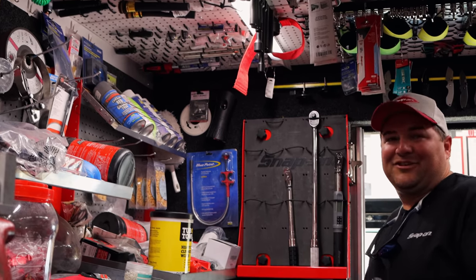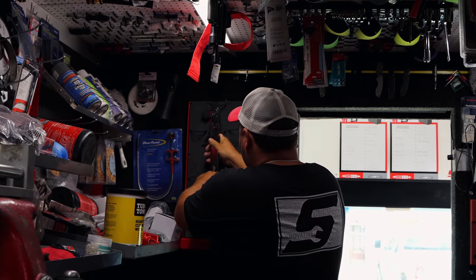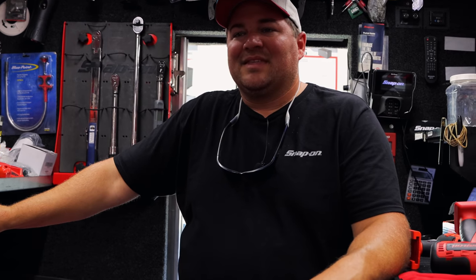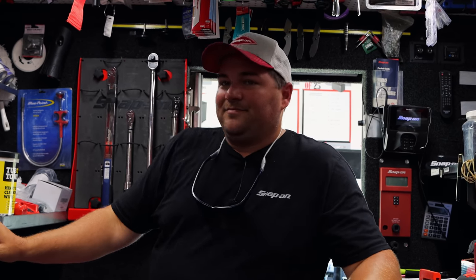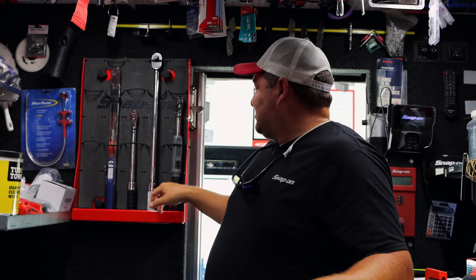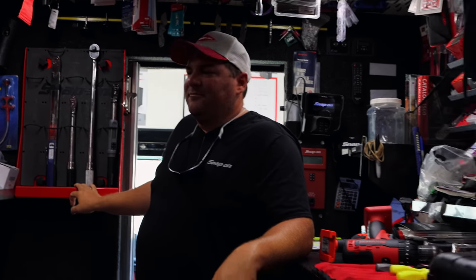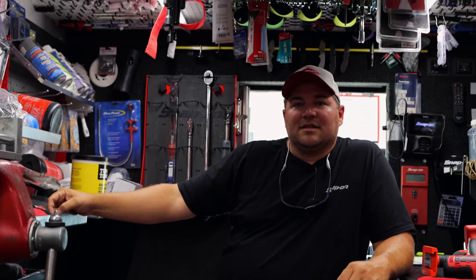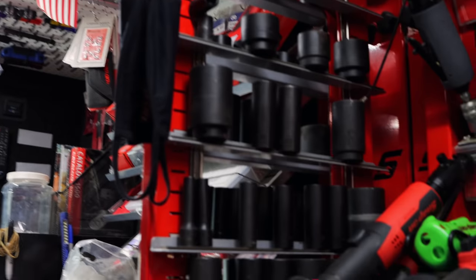That is a perk of a digital — you don't have to zero them back out. But I prefer the click because every single time, say you got 80 foot pounds, it'll beep and it'll be like 80.8 or 81.2 — which is close, but you're not going to stop exactly on the digital unless you're doing it super slow. The click style is a lot easier as far as feel. But I got all the digital — I like the vibrating, the lights and all that. My son uses the three-eighths all the time on his junior. It's a lot easier for him, it's already set. But I take the batteries out of mine all the time — that's a high-dollar tool to have corroded batteries one day.